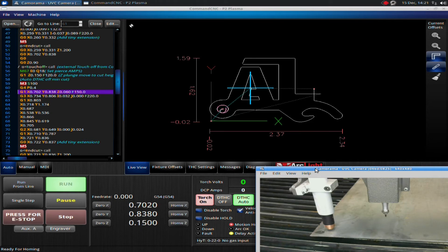The next thing you want to do — before you fix any errors — you want to hit the stop button. Because right now the machine is trying to turn on the torch; it's in the middle of a run. Because it's trying to fire the torch, that can cause problems. You don't want it trying to fire the torch while you're fixing an error on your plasma. In order to usually fix the errors on your plasma, you have to cycle the power switch. And when you cycle that power switch off and then back on, if your control system is trying to fire the torch when you turn it back on, you're going to get another error — basically a trigger was pulled when the power was turned on, and it's a fault.